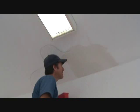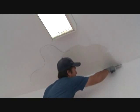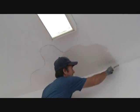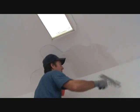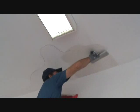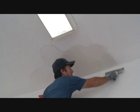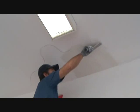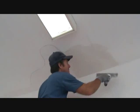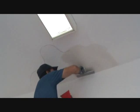Now that looks pretty good, but I'm still going to make it just a hair tighter than that. Before I get this edge, I've got to make sure I concentrate on keeping pressure over on this side, more so than the middle. Get up there and have more pressure over on this far side as you're pulling it off. I pulled quite a bit of mud off — I've got a little bit right there. I'm going to put it over like that and drag that off. I've got more pressure on that outside edge, and I'm just letting this top float so I don't have a line in my mud at all. Now the middle — I can wipe that. Same pressure all the way.